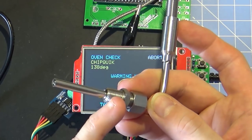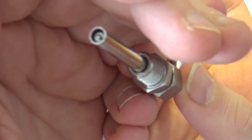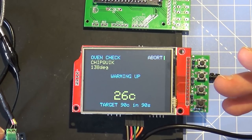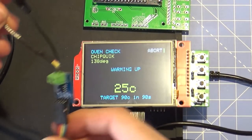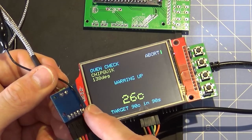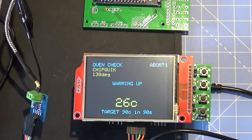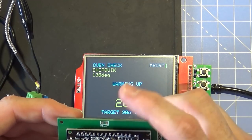The actual sensor is right at the tip but shielded from the outside, and that caused another problem with grounding. The readings I was getting were totally false unless it was correctly grounded to the case. Since this is metal on metal on the back of the reflow oven, I soldered a small jumper wire onto the metal braided cable on the outside and then onto the ground portion of the board. That was a common fix I found when searching for thermocouple incorrect readings.